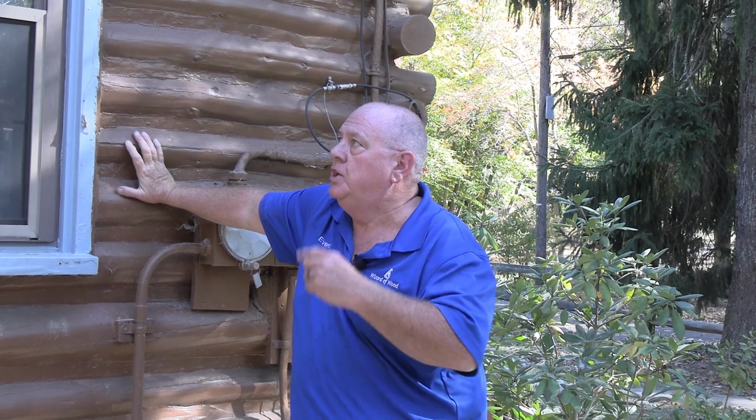So this is an older cabin that we want to take care of, but we also want to be less intrusive to the interior of the home. Now, crushed glass can still get to the interior in any compromised areas, and we're going to find that out. We've plasticked the interior walls so that we're containing it if it does get through. We had two spots where it was getting through, which isn't terrible, and it happens on these kinds of jobs, but it's much better to get something dry like the dry media than it is water.